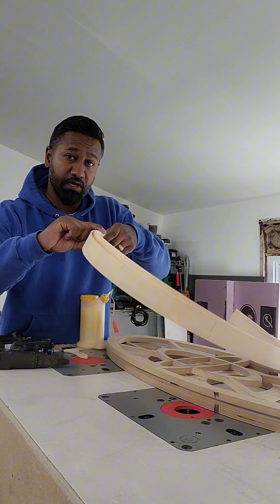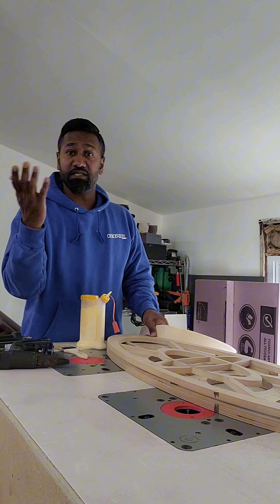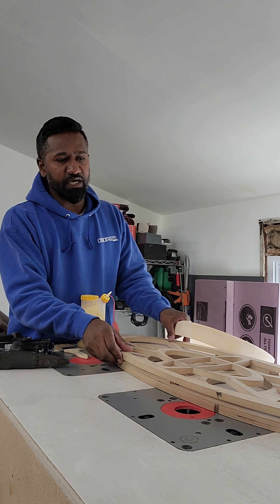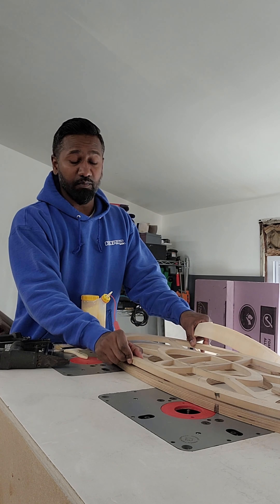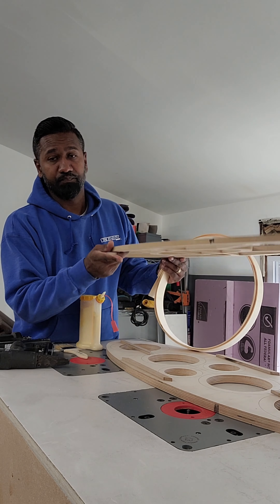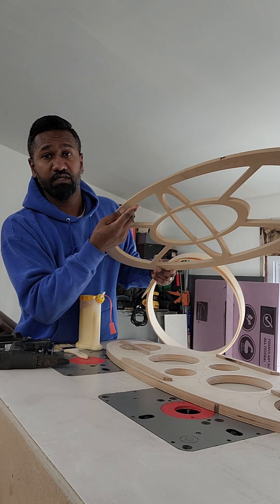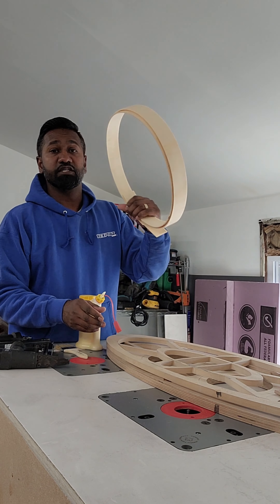I already cut the bendy to size — inch and five-eighths. Here's why: we've got three-quarter inch material on the bottom as the baffle mounting plate, half inch as our finisher grill. Usually the thickness of a speaker basket is around quarter inch, so I used a couple of strips of quarter-inch material as a spacer, then added a little bit extra. Why? Simple — when you wrap your grill, that material goes over the rim of the speaker and it'll bump it out, so I added a little extra. Let's get it on there.